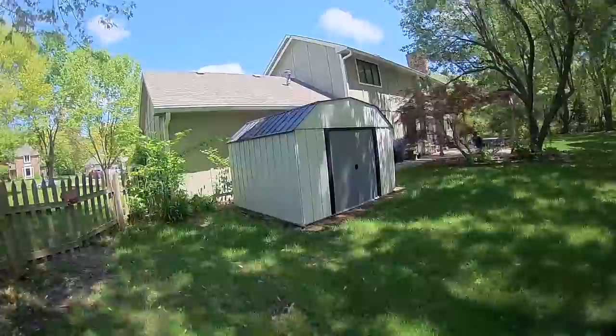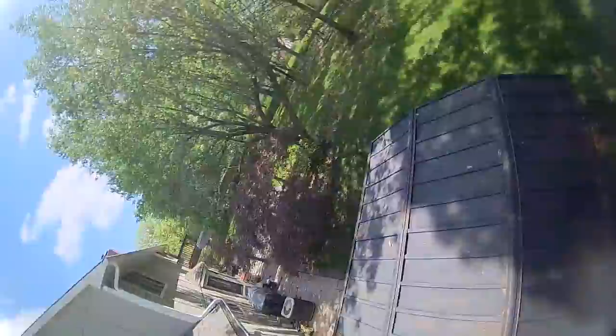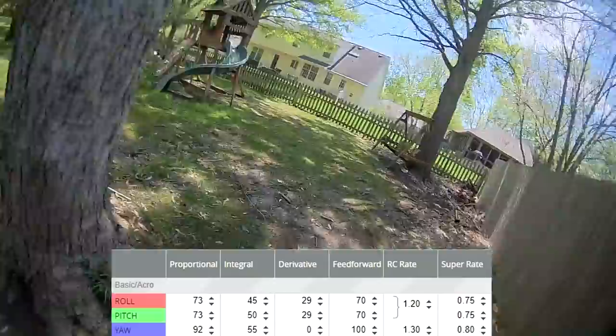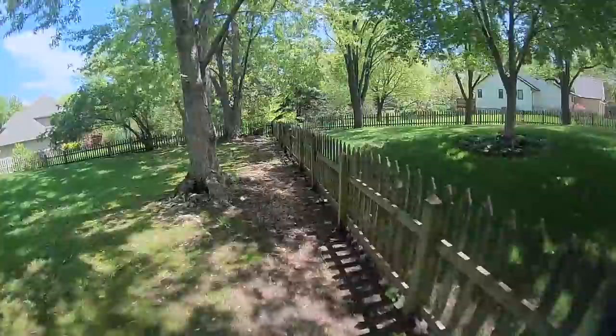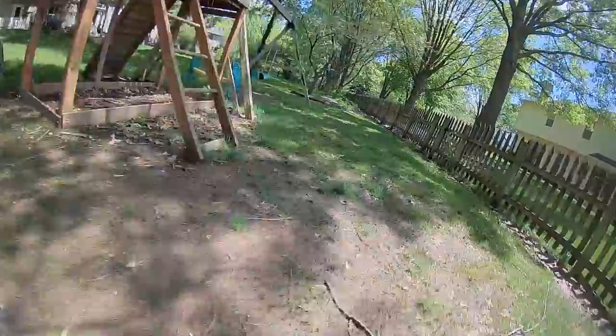This flight does show a little bit of prop wash — you'll see it come out every once in a while with the jitters and things of that nature. I think I've got my D values too high still. If you missed those PIDs I put on screen earlier I'll put them on again now, and I would lower those D values by somewhere — I would start with at least five, maybe even further down, because that's what I think is causing that prop wash. But again I have a deficiency in my PID tune where if you do flips or rolls you've got some pretty big bounce back. You can fly around that if you have the skill set by not dead sticking the flip or roll and instead finishing it slowly rather than trying to nail it in there.